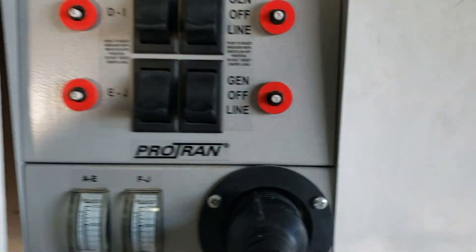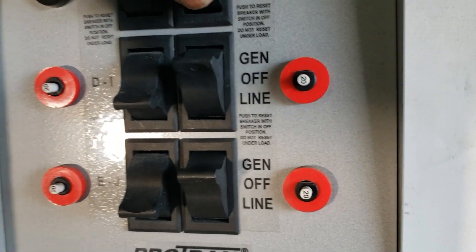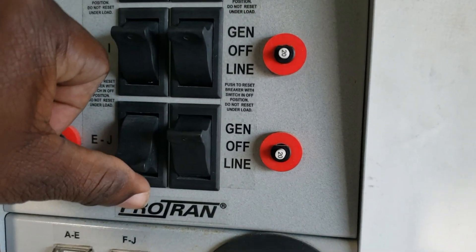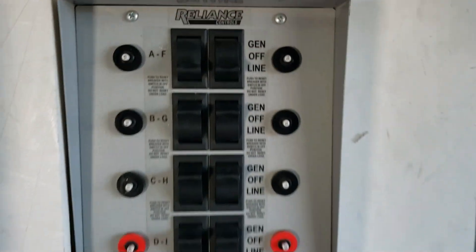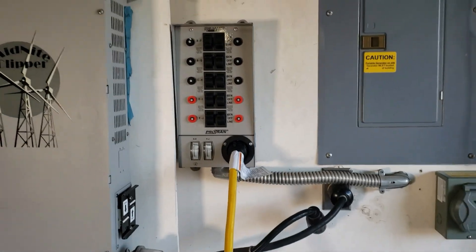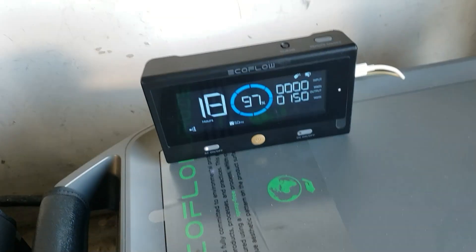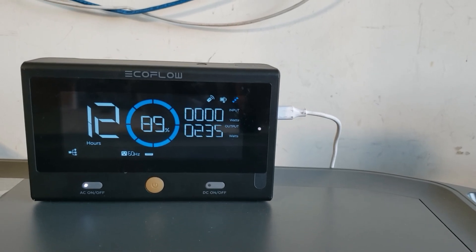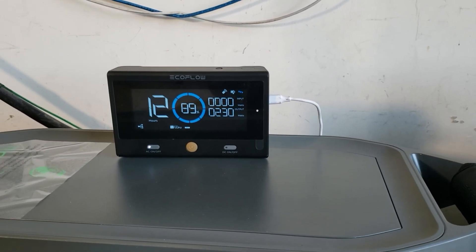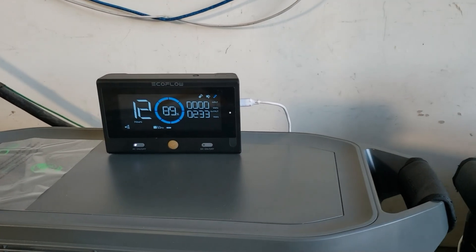I'm going to go to the other side and turn on this side, and you see this one pops up. I don't have much load on this side. Let's just turn on all the loads: master bedroom, garage, detached garage, kitchen, microwave, guest bedroom, and on top I have my main house heater and my septic. I'm not going to turn those two because the heater's running. We're pulling 150 watts on this one and 230 on this one. For those who think it has to be balanced — when you use 240 it will balance itself. Right now I'm using it on a transfer switch and it's going to do each leg.